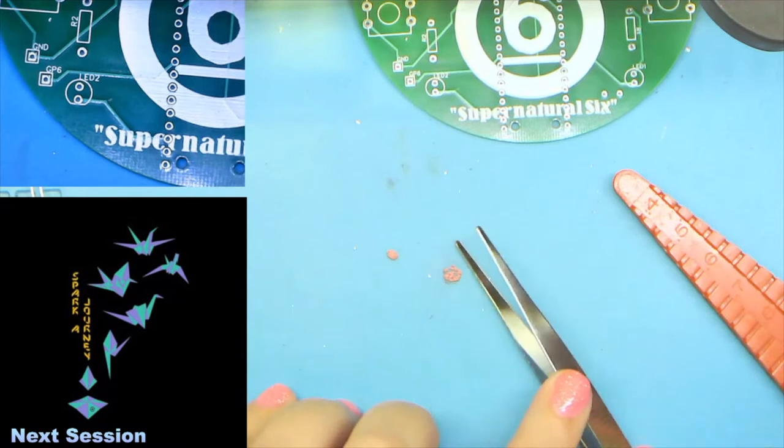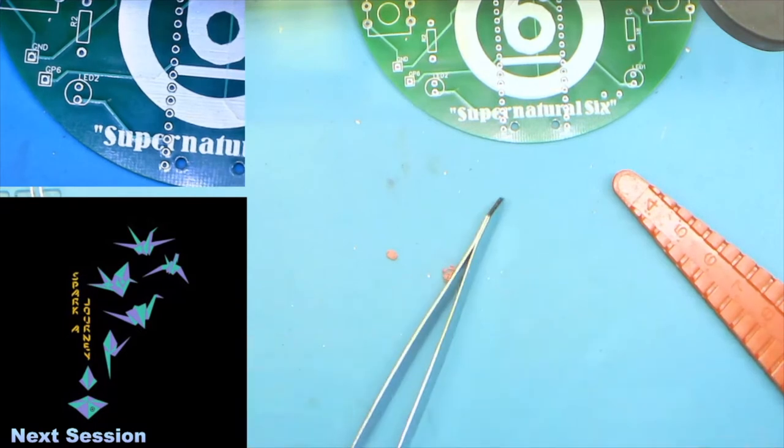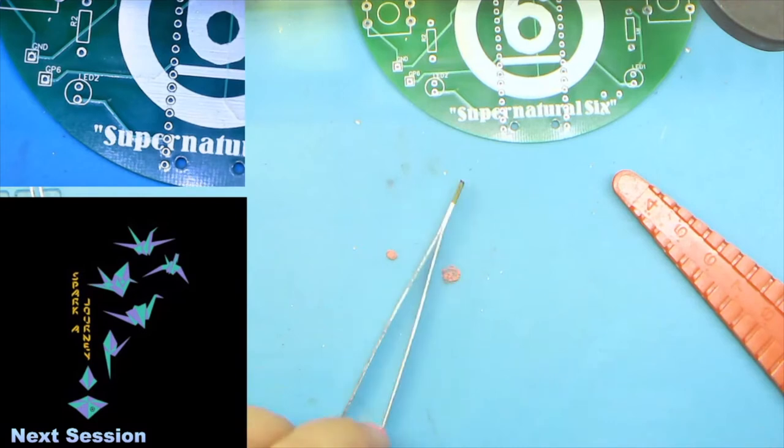These are some cheap ones that came in a kit. I kind of would stay away from these if you can, because they are not coated, any static discharge on your body is going to be transferred to your work.